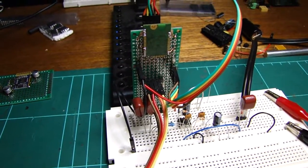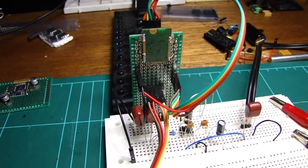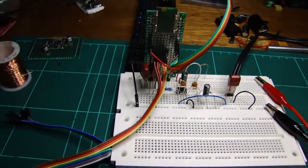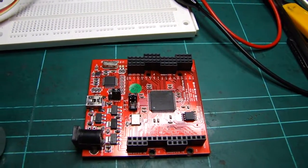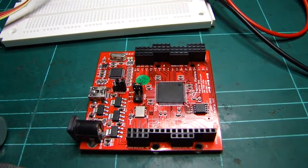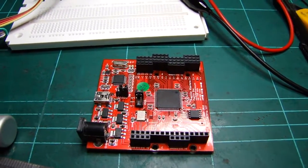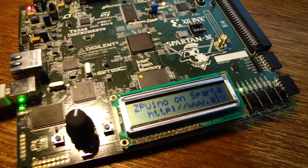So I've switched it to I2S mode, which will go up to 48kHz — more than enough. So that's why I want the ZPU running in this FPGA: it's going to be monitoring a bunch of buffers and I'm toying with the idea of doing floating point math to do the actual audio mixing, rather than just basic integer maths for attenuation and stuff like that. There are a couple of FPU cores and they seem fairly easy to understand, as much as FPUs and floating point in general are. I was going to give it a crack given this is an interesting project.